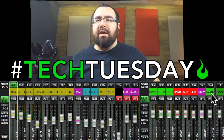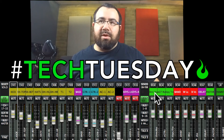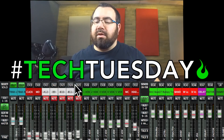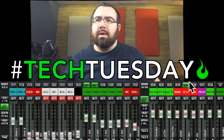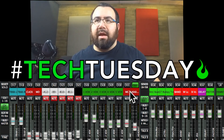So what I'm going to show you real quick here is how on the X32 to assign DCAs — it's very quick and easy. If you're on the actual board, you'd hold down the select button over the DCA you want. In this case, I'll just click the DCA button and then go select the channels. So I've got drums and bass, guitars on DCA-2, keys and tracks, my entire band, my worship leaders which in this case are channels one and two, my BVs, my delay send, and finally my pastor's headset microphone.